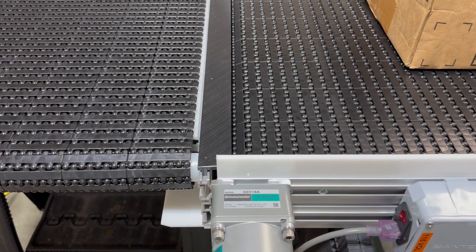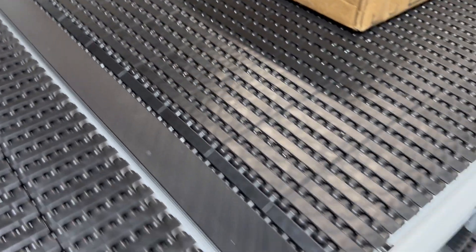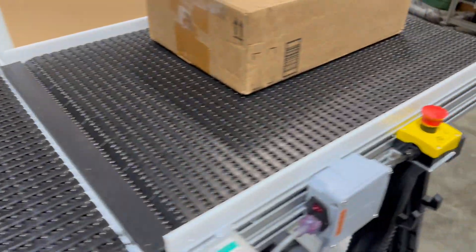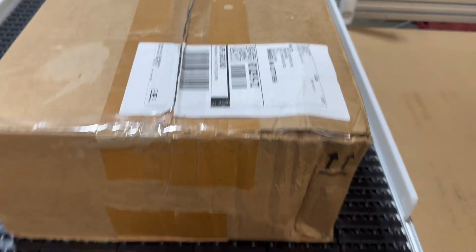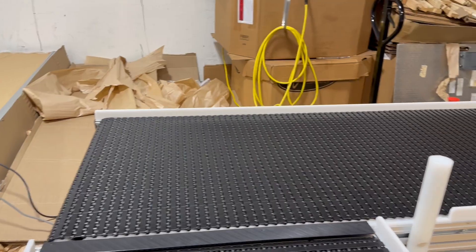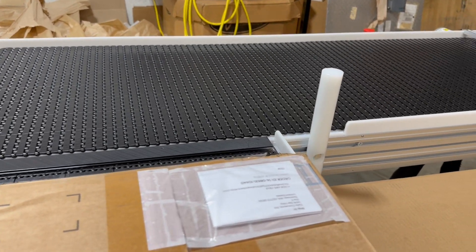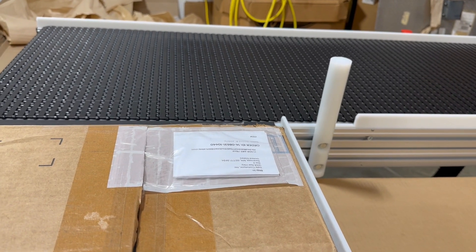On our conveyors it's a simple matter of taking out the guardrail and installing a transfer plate. If you have something in a box and it's high enough, you can probably skip that. As the box turns, it's moving on the belt in that direction, and when it hits another belt moving left or right, it's going to follow that. At some point when it gets off the driving force, it's going to be pulled in that direction and try to go to the right — but it can't because it's going to hit the guardrail.